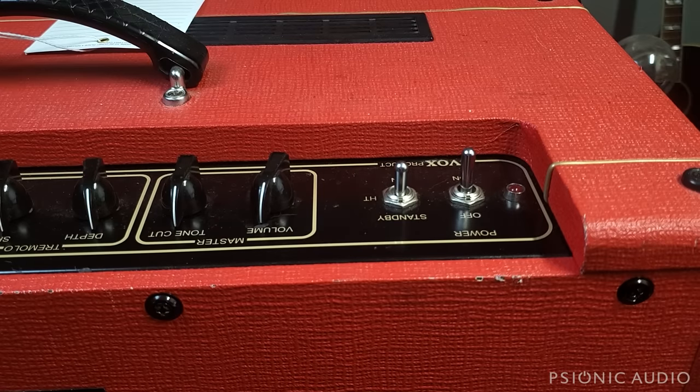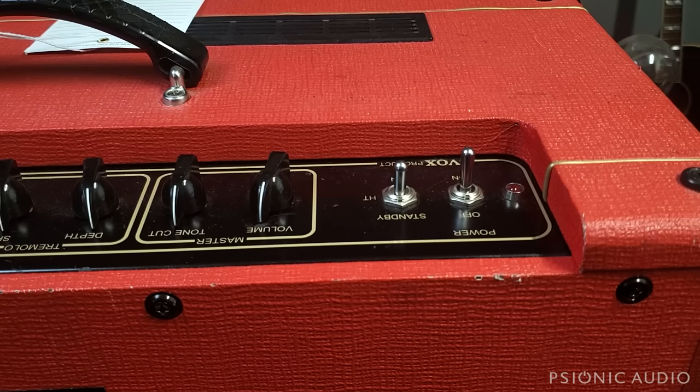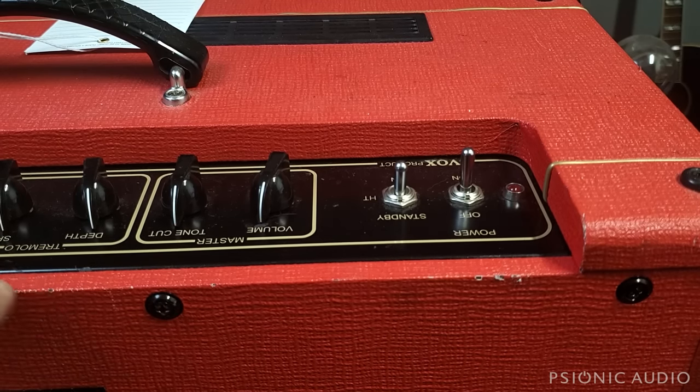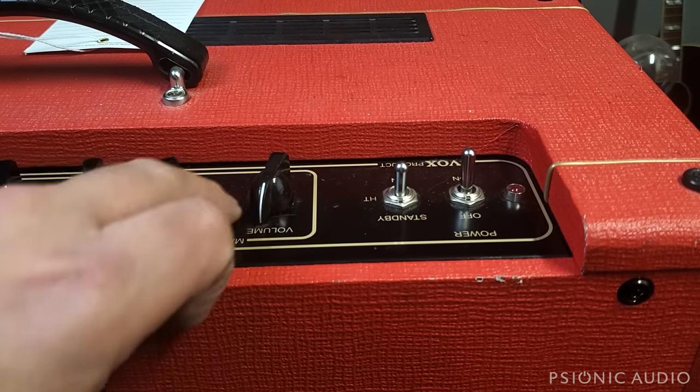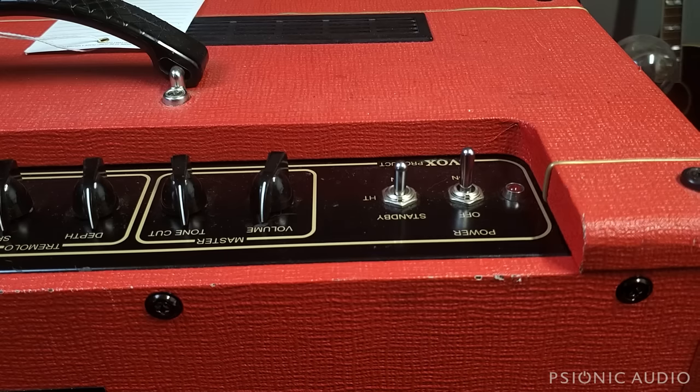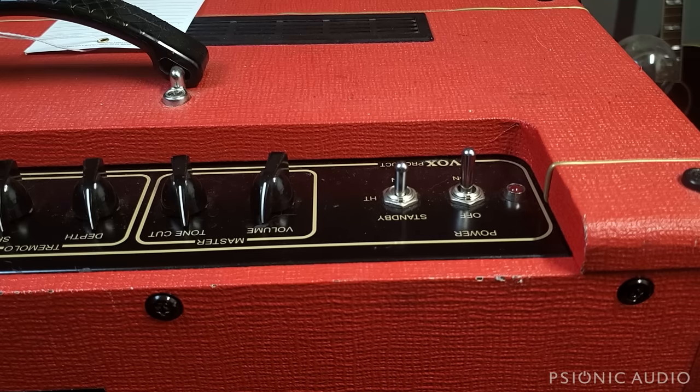If you have an amp which has a cathode follower stage, that's most Voxes, the AC30 and some AC15s. Some of them have it plate-driven rather than cathode follower. But most Marshalls, most Voxes, the Tweed Bassman, the Tweed Twin, the tone stack is driven by what's called a cathode follower stage. And that has the grid of one triode directly connected to the plate of the previous triode.